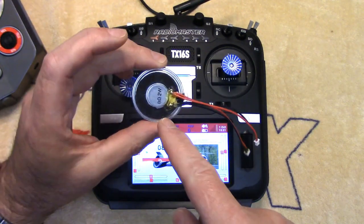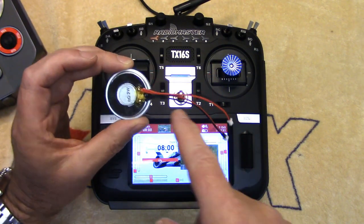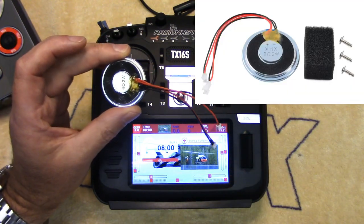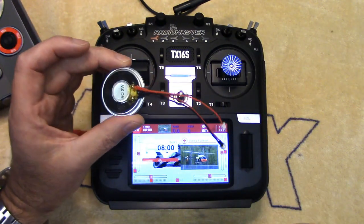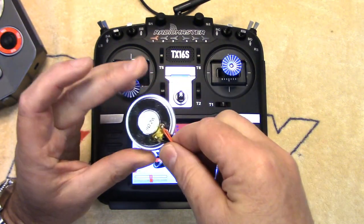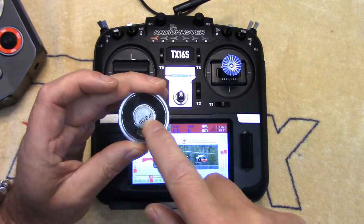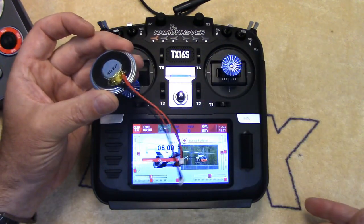It's pretty simple. I actually had to build this one because they didn't have the available Radiomaster speakers yet with the harnesses already soldered on, but now they do. I will link to it below in the description. If you did want to build your own — not that I'd recommend it because you can get the Radiomaster one for so cheap — these are just a 40 millimeter speaker and very important you get the right values: 8 ohms, 2 watts, and it is hooked in parallel with the internal speaker that's already in there.